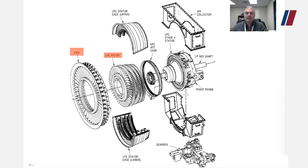The low-pressure compressor rotor is the rotor that actually rotates with the blades mounted on top of it. The blades are mounted by a dovetail mount — either an actual dovetail or a circumferential dovetail. The rotor itself is made up of discs and spools. The disc will take the actual mounts and the spool piece will take the circumferential mounts. The stator case houses your vane assemblies, and the vane assemblies cause resistance to flow and an increase in pressure in the compressor.